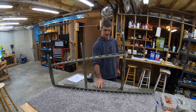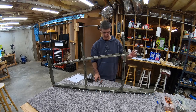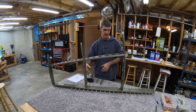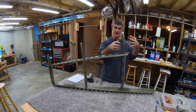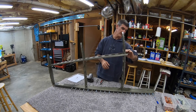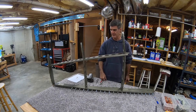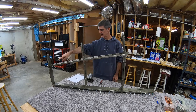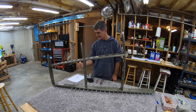The rear spar is assembled except for the lower bottom hinge bracket which comes later. It's time to rivet basically the top two-thirds of the skeleton together. You leave some parts clecoed until you're putting the skin on so you can take parts out and put them back. These last rivets - the last piece of the skeleton - are riveted on right before you do the bottom of the skin. It's basically 11 rivets: three, six, nine, ten, eleven.